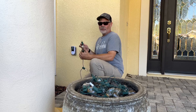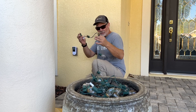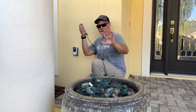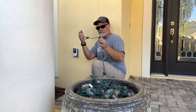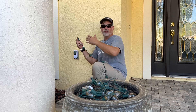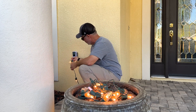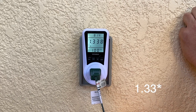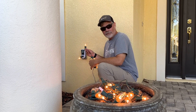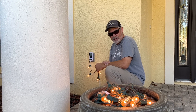Just to give you a compare and contrast, here are old-school incandescent lights — 25 bulbs at 6-inch spacing. These are glass and I've already broken one. I want to show you the amperage they draw. The 235-foot LED run — probably 200 feet of actual lights — pulled 1.2 amps. Now let's see what just 25 incandescents pull: 1.43 amps. So 25 incandescent bulbs draw more than 200 LEDs. That's the big advantage of LEDs, even though incandescents are beautiful.